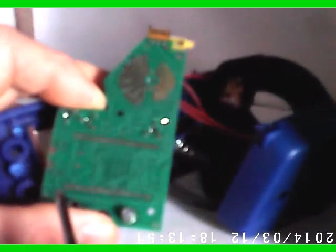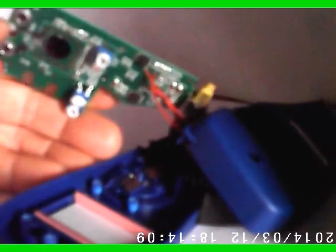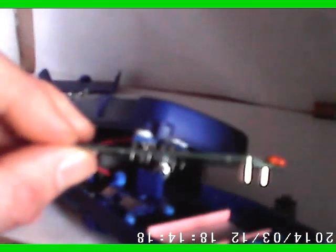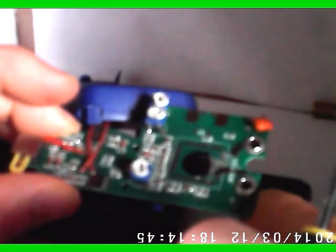The wiper is soldered, however the other end contact is not soldered at all — at least not on this side. Let me see if it's soldered on this side. It may only need to be soldered on one side. And it is not soldered on this side either. That contact is present on both sides of the board, but unsoldered. I would definitely consider that something that got past the boys in quality control.